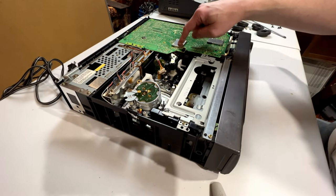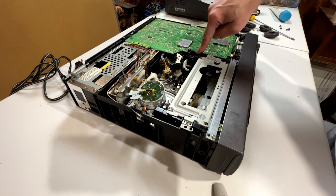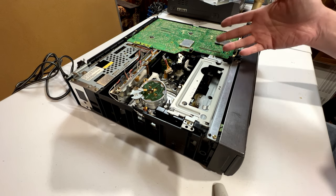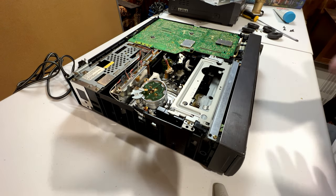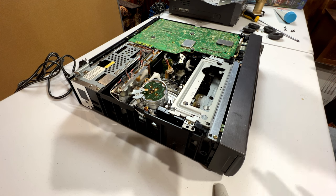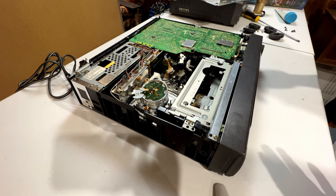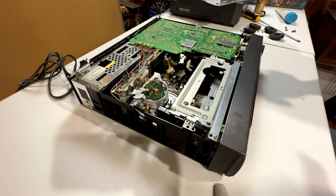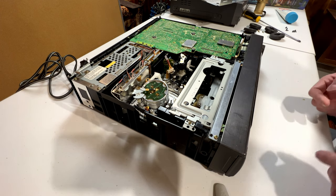He got in there with a small strand of wire and sort of got it working again, but I wasn't happy with that, so I had to do it all over again — which involved taking the stator off, adding spacers, and completely redoing that jumper wire. There's a very tiny trace right about where my screwdriver is pointing; if you pull that trace up, good luck fixing it. The hi-fi dropout problem in my 4700U turned out to be just the deck being out of alignment on the hi-fi end — it was not recording to the proper signal strength. There's an adjustment for hi-fi power level on the lower board. By trial and error, tweaking that control and recording and playing back content, I finally got it after eight years of trying.